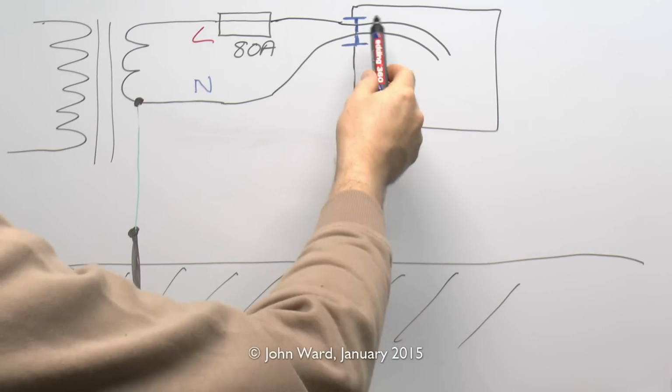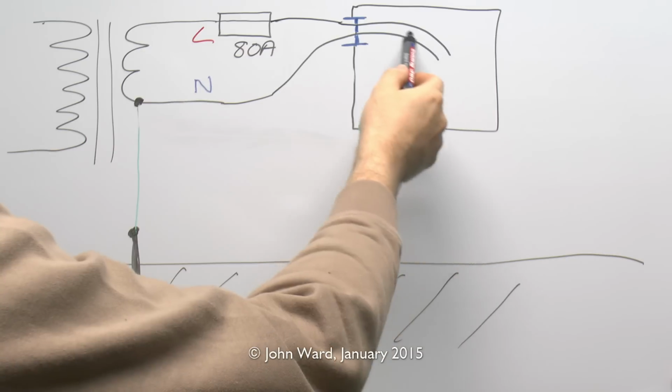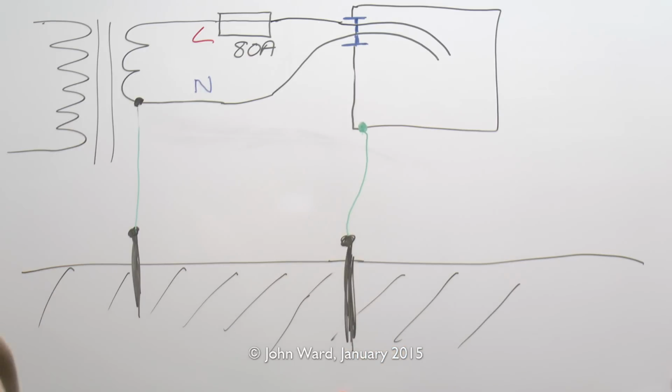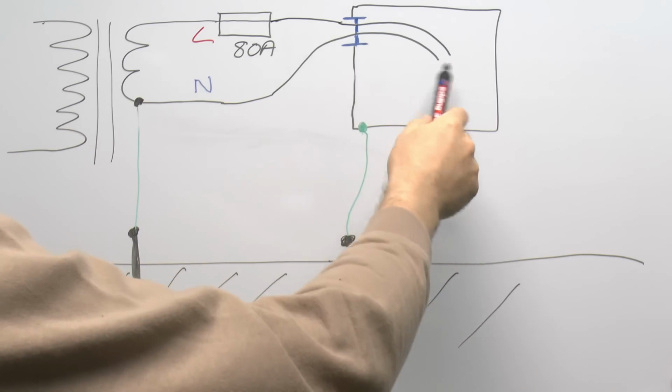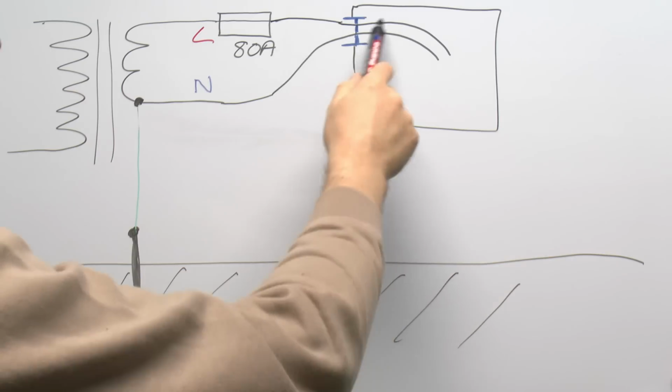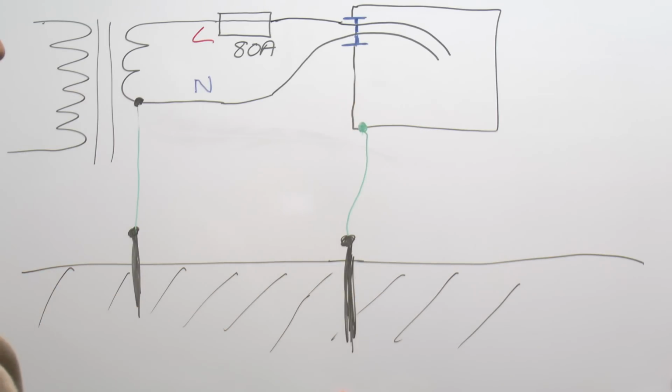But of course that still doesn't prevent any issue if the cable inside here became damaged and say shorted onto the metal casing or the back of it or whatever, because you're still actually before any of the protective devices within the consumer unit. And although things like that are probably fairly rare, it's certainly not impossible, particularly if there was something inside which overheated and caused the insulation to be damaged. And of course that exposes live wires which then could easily have shorted onto metal components inside.